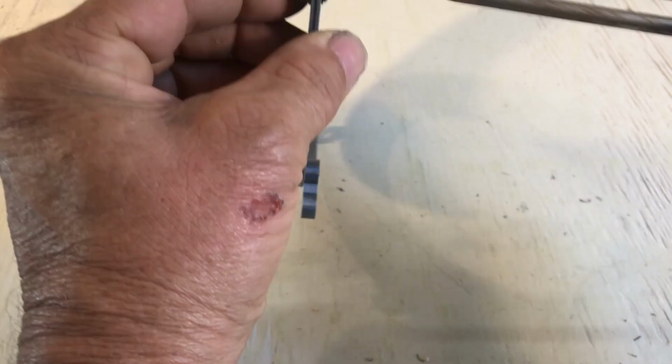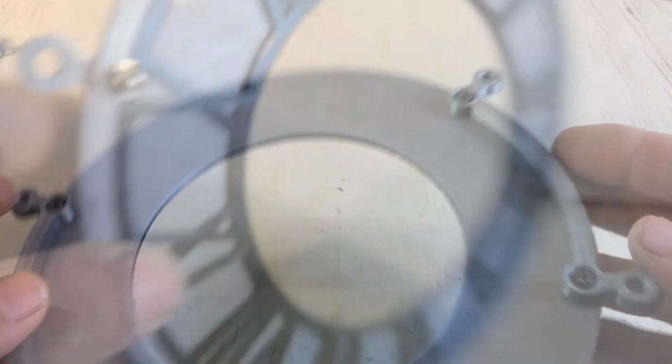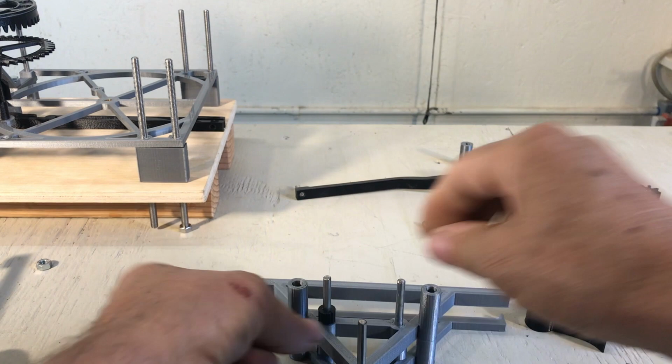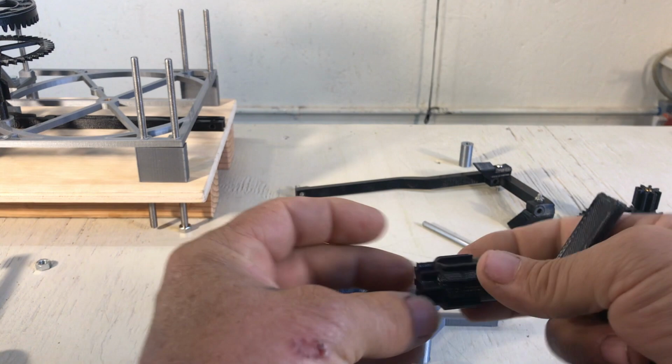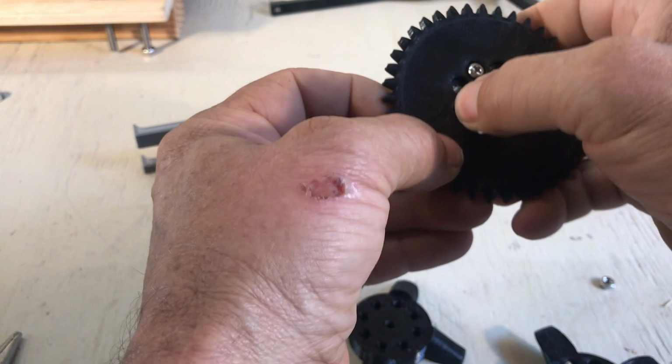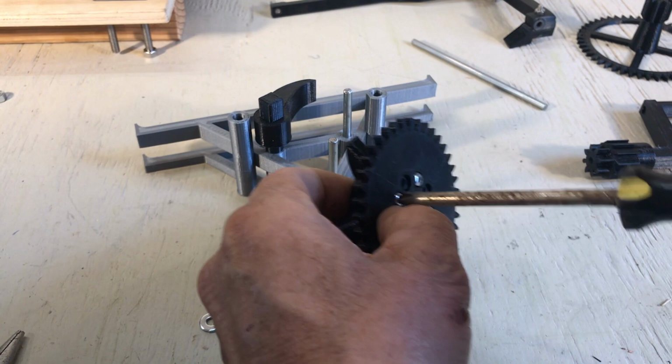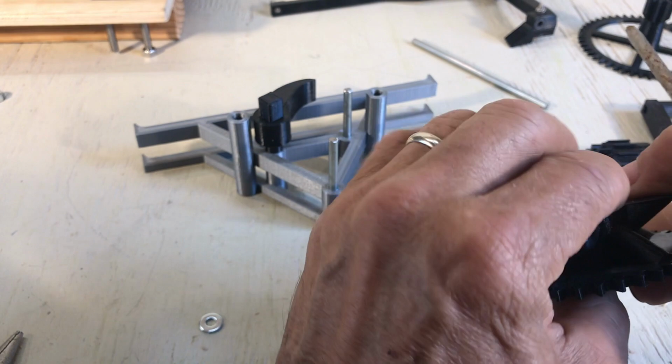The front face, it's 3 different pieces that are just bolted together, and two brackets on the back. Okay, that's the rewind mechanism. Those three shafts, that's the ratchet and the gear with the pulley, one half, second half, bolt everything together. Make sure the bolts don't stick out and catch.